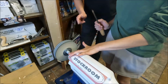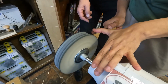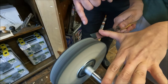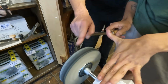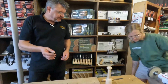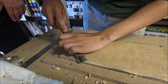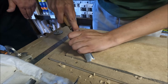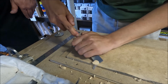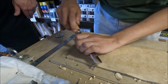Remember, anchor hands. All right. Find that edge down below. Yes. So you want to see compound coming up on the edge. Yeah, lovely. That's it, enough. And then just take a little off the inside of the bevel edge. Lovely, done. Right, now see if you can feel a difference. Anchored down. Oh, wow. Can you feel it? Yes, I can. And isn't the cup more polished? Very much so.